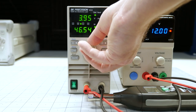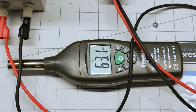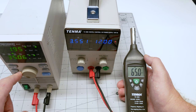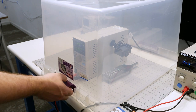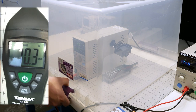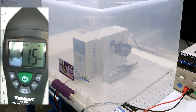Next, let's get near the max of the power supply by drawing 4.95 amps. Look at the sound reading now — almost 64 decibels. Well, here's the thing: it's not the load. It turns out the load's fan spins at a constant speed, and the additional noise is from the power supply. So to isolate the load, I put a plastic container over it and stuck an action camera inside so we could see the sound meter's level. Inside the container, we can see about 70 decibels with either current draw. Remember that 70 decibel level, because that gives us a baseline to compare to later.